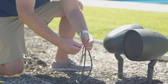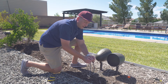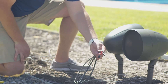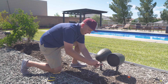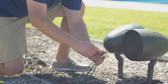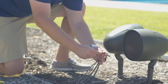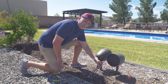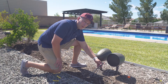Make sure the wires are wound nice and tight before installing the wire nut. Use the gel-filled wire nut, twisting as you apply it down around the speaker wire, making sure you get all conductors up inside. Don't leave anything stray or it'll corrode or potentially short. Give it a couple of good turns so the wire holds itself together, and repeat that for the black conductors. I also like to install one more zip tie on the tag end of the speaker wire to keep these from accidentally separating and to keep the wire nuts under as little tension as possible. These are UV-coated and weatherproof zip ties, so they'll hold up for a long time.